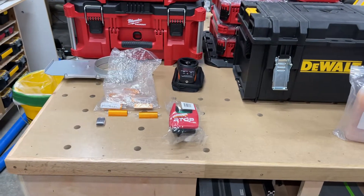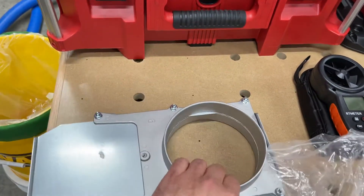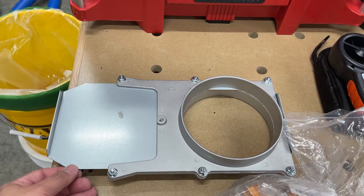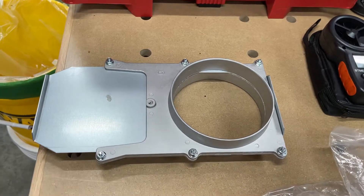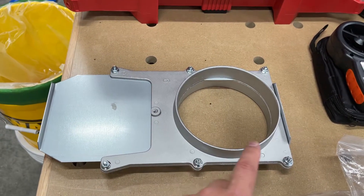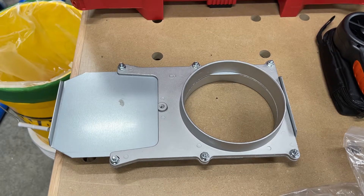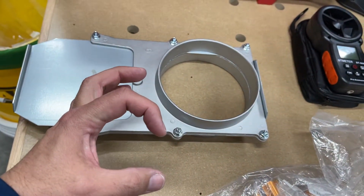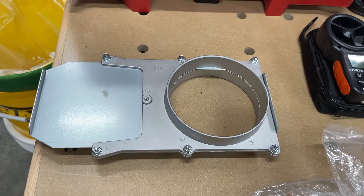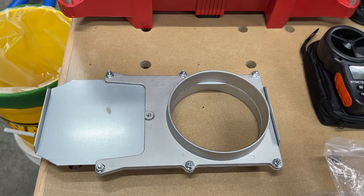Number one, I gotta figure out how to automate this thing. I have an idea on how to make a motorized blast gate using some of the GT2 timing belt pulleys that a lot of 3D printers use, so those parts are inbound. I like using linear actuators but they're slow. I ordered one that was fast but it was huge — about two and a half inches around, much longer, and it moved at about an inch and a half to two inches per second on the four-inch one. It just isn't suitable.